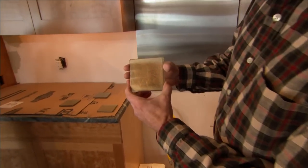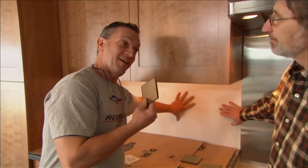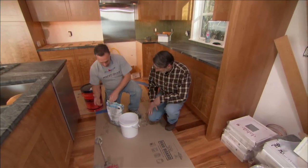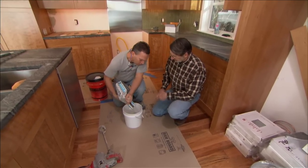We've used glass tile in the past and it's a little bit tricky to install because you can see through it. That is the challenge, because it is a translucent tile — whatever you mount it to, you're going to see through. So our back wall needs to be the color that you want to see through the tile. We're using a light green grout that our designer chose, and it is a grout — but grout is a filler, it's not an adhesive.